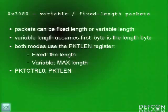Fixed length packets are far more common, and when you're doing attacks and finding out what a system's actually doing, you're probably going to actually just want to use fixed length packets and set it to something low, but large enough that you can identify that it looks kind of consistent with the packet that I just saw before it. It's about spreading a wide net and then narrowing down as we can determine different aspects of the radio talking.